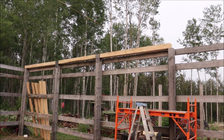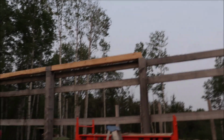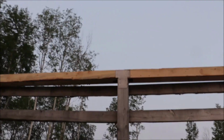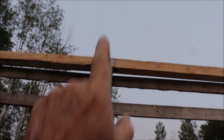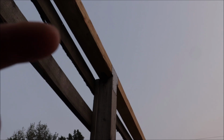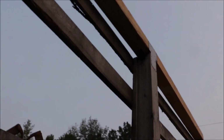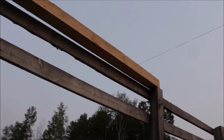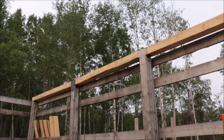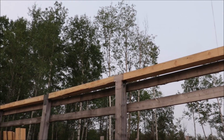Alrighty. Alright, well that is the 3 of them up there now. 2 more on that wall and we're done. Yeah, again, we had some stuff to do this morning, so that's why we only have 3. And I sure hope you understood what I mean. These front plates here are only to keep the beam from coming up, but to keep from going this way, that's why these ones are under here. I'm hoping they'll keep them from going this way, because I'm gonna be pulling on that beam when I start pulling in the wall. And then the floor joists will be set up there. There's nothing holding the beam on the far side. There may not be until the 2x6 gets nailed on the outside of that. Then eventually there will be something there. That's what I'm up to.